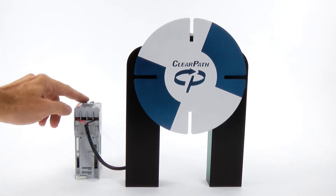With an acceleration of 600 RPM per second and a velocity of 1200 RPM, it'll take 2 seconds to accelerate to the set velocity once I apply power.